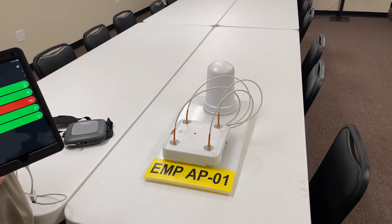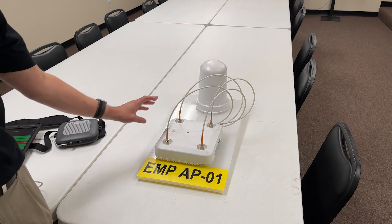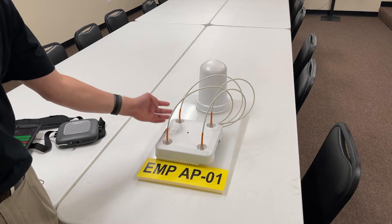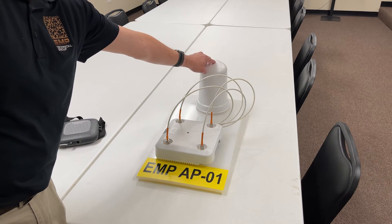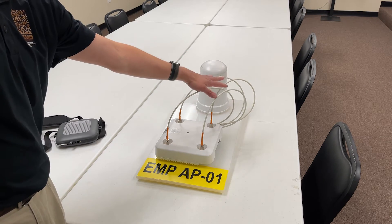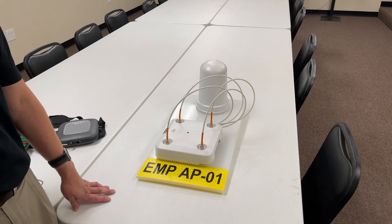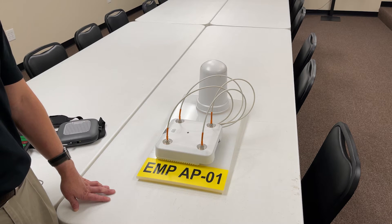Let's look at this access point over here. That's a pretty high-end Cisco access point, right? Yeah, this is a Cisco 2802 — it is a very nice AP. This has been replaced since Cisco updates them about yearly. This is our favorite antenna though — this has not been replaced. This is an omnidirectional antenna; it has one connection into one antenna and it has great range. We mount these to a board with identification for which access point this is. In warehouses these might be 30, 40, or even 50 feet up in the air, so if you don't have good identification you're not sure which access point you're looking at — frankly they're hard to find.